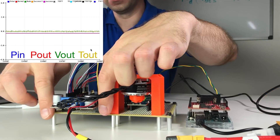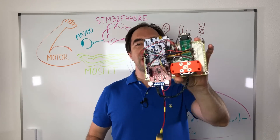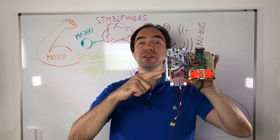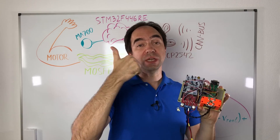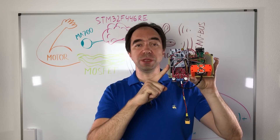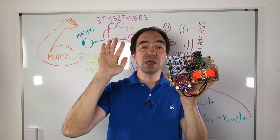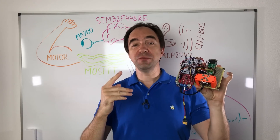The motor is cold and the board is cold. Today we have built and tested the MIT Mini Cheetah controller. It's a really fast and agile controller. I really like that it gives you fast measurements of torque, position, and speed. This should be perfect for a collaborative robot — you can easily detect all kinds of collisions. We're going to do that kind of test in one of the future videos.